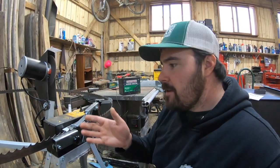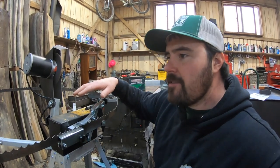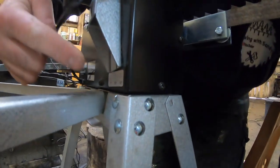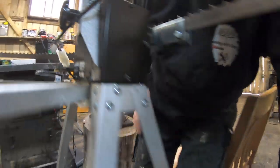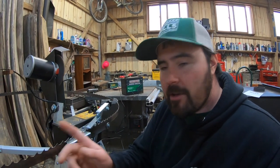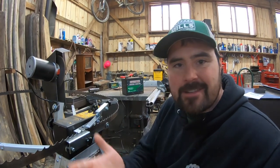The settings I have for this blade — this is a Lennox blade sold by Woodland Mills — is a 10-degree grind. If you look at the back here you can see the numbers: 7, 10, and 14. I've got it set up for 10 degrees. From what I can see, that was very close to what the angle was originally on the blade when it was shipped to me, so I don't have to take too much material off if I stick with 10 degrees.